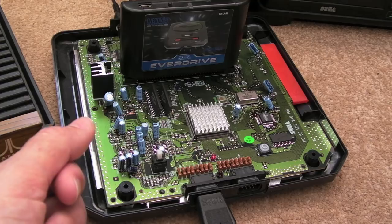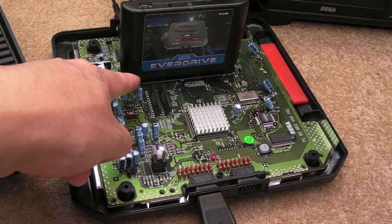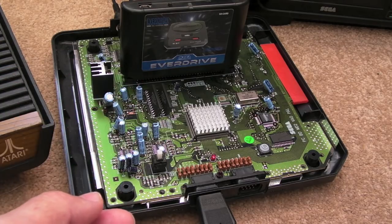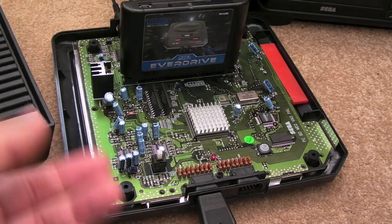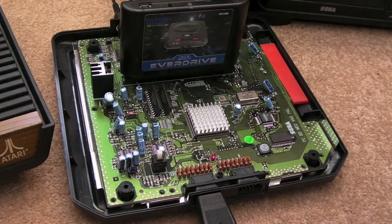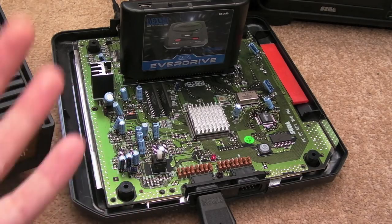In most cases, I would say in something like 70 to 80% of the cases, it has just been a dirty cart slot, nothing more. That can give you a black screen. I think the first Mega Drive video I did on my channel was talking about that, actually. It was when I picked up my Mark I. That was exactly what was wrong with that. It didn't matter how many times you put the cart in, you couldn't get it to boot at all.